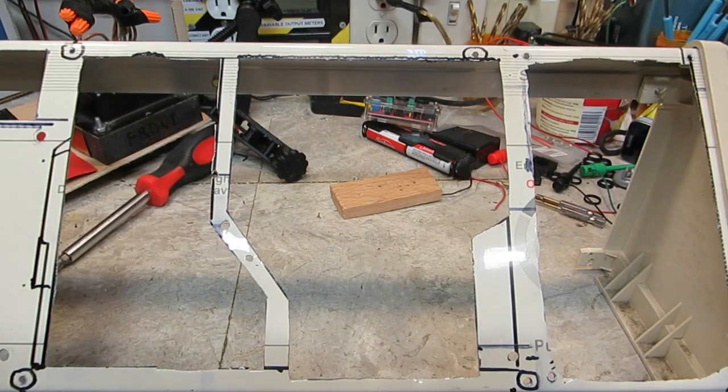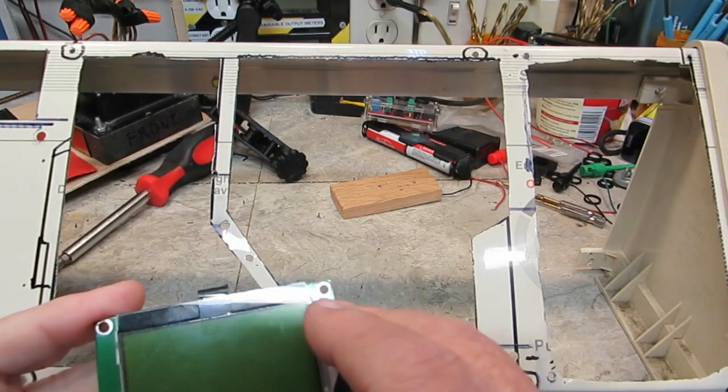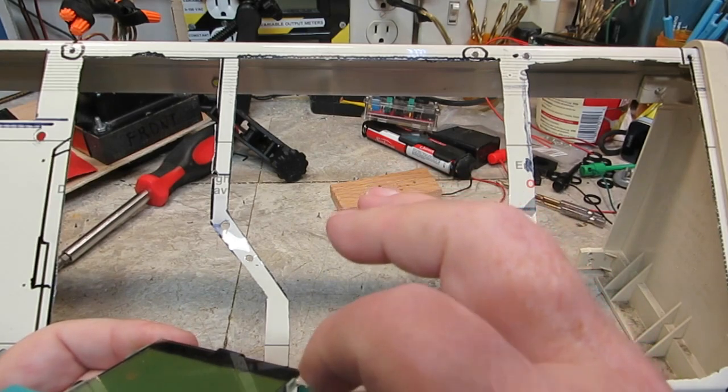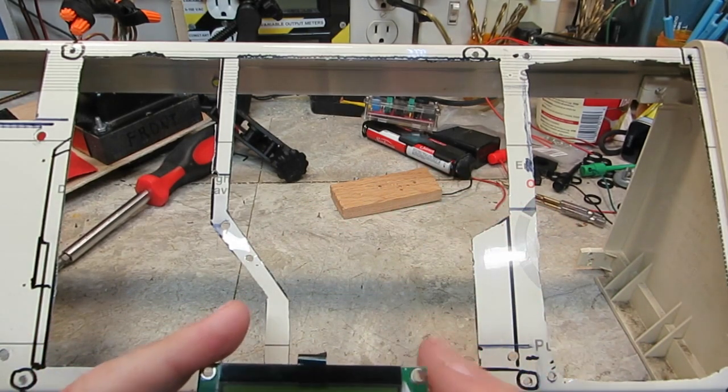On the tester itself, I'm going to make some spacers on the 3D printer. I want it to come up off of the board like that, where these screws will allow the board to sit flush. Because there's a thing here that's not going to allow it to be flush — I need it to be at least that high off of the board for the spacer for the screws.